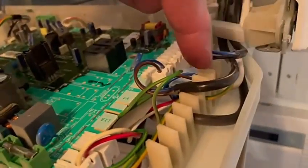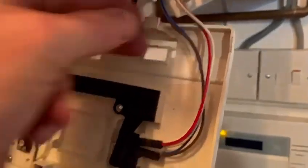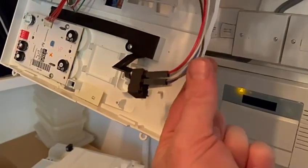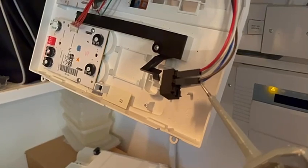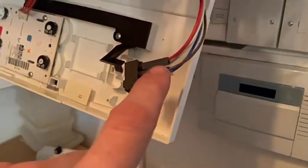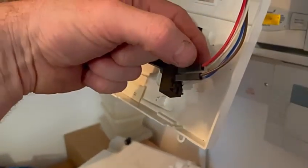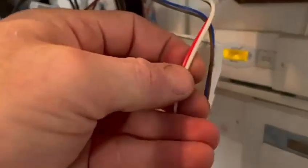As you can see, the live is on and the one on the far left is the mains live. I'm just going to probe onto this - as you can see that's indicating the far left one, which is the mains live, is live. We've got this control board here, looks quite complicated with lots of connections, so I need to follow that live through into here. It comes through into this white cable, which then goes underneath and comes down to these two wires here - the live and neutral. I've got the live and neutral coming through into this side. This is a reset switch or an on/off switch, and I've tested that there's live and neutral there.